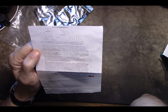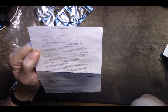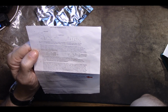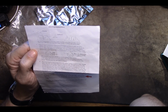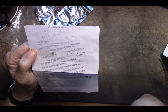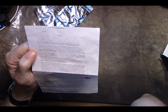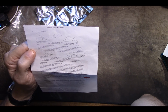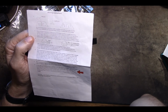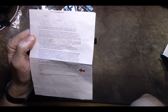After printing, heat bed to 80 to 90. Now you're supposed to print without heating the bed. Then it says, after printing, heat bed to 80 to 90 C to remove printed object. At this temperature, coating becomes tacky and flexible. Use razor blade to get under object, then sharpen putty knife to continue breaking the bond under the model. The hotter the bed, the easier to release. After bed is back to room temperature, then they tell you how to prepare it again for the next print. Call if you need specific recommendations.